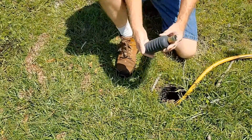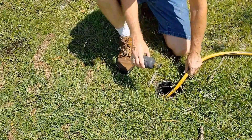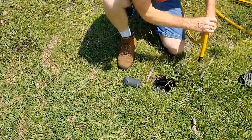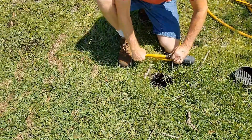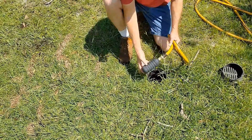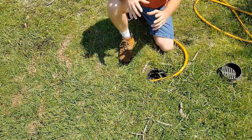They call this a drain bladder — I call it a flush bag. What it does, it's got this little pinhole down here, and it's going to fill up with water and expand inside the pipe, not allowing any water to come back this direction. Let's hook this up. I'm just going to pull the hose back — remember, the hose is on right now. Again, they call this a drain bladder, but it's better to call it a flush bag. We're going to stick it in the outlet side of this catch basin. You can hear it kicking on — it just totally expanded inside that pipe.